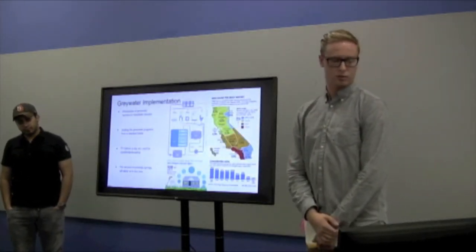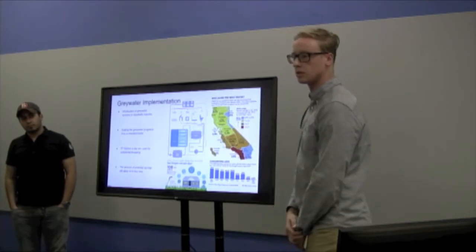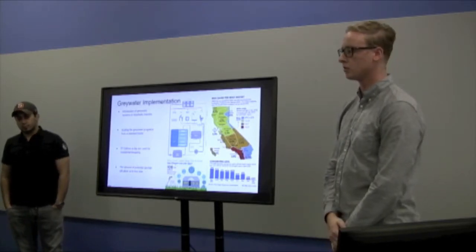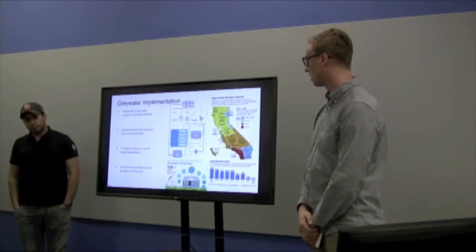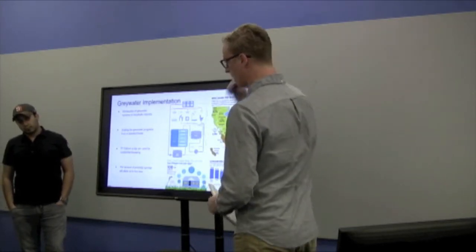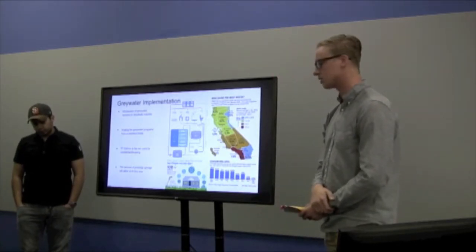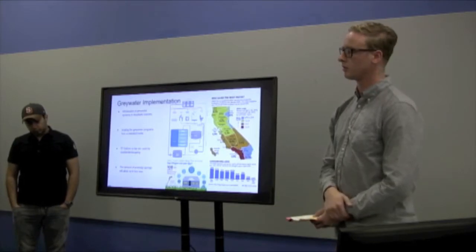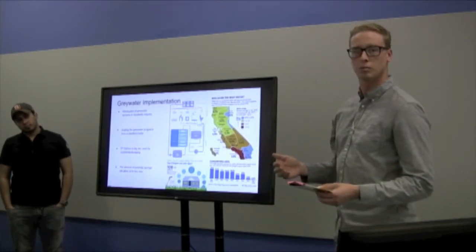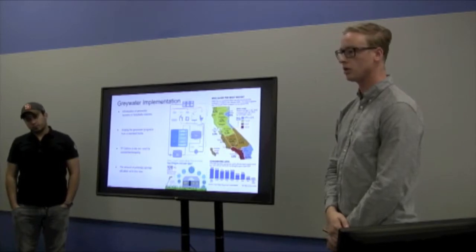My research focused on gray water and how to implement it in San Diego. Introducing gray water systems to the hospitality industry could greatly reduce the use of potable water for irrigation, toilet flushing, and similar purposes. 57 gallons a day are used for outside landscaping. According to a study, a family of four produces around 60,000 gallons of gray water a year — about 15,000 gallons per person. Extrapolated to a housing development with 100 people, that's 1.5 million gallons of gray water annually that can be used for toilet flushing or irrigation.